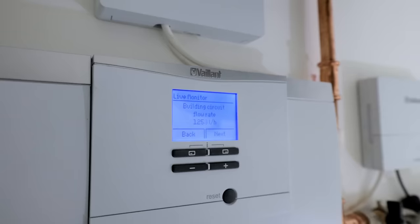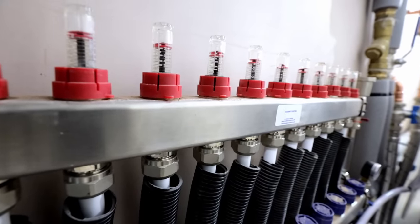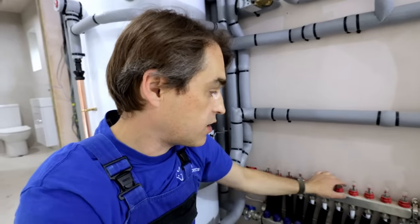The first thing I'm checking are my flow rates — I'm expecting between 1200 and 1400 litres on heating and the same on hot water. My primary run is very short, less than three metres from the external unit. Going through the menu, the maximum flow rate on heating at fixed pump speed of 100% gets close to 2000 litres per hour, which means that at my correct flow rate of 1200–1400 litres, the pump only runs at 40–50% power. The system is designed with such low resistance that the pump will never have to work hard, consuming less energy and lasting longer.